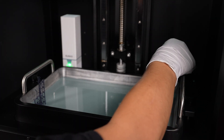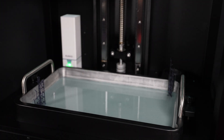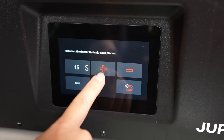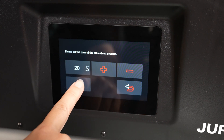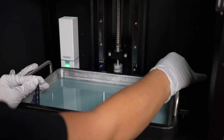I take the supports and stick them on both sides of where the screen is. Then to clean the tank, I just go to Tools, then Tank Clean. I'm going to set it for 20 seconds. When you hit Next, that's when it's going to start, so don't do that until you're ready, because you're going to have to hold the supports down into place so that they will adhere to the bottom of the tank.